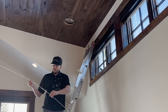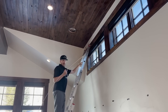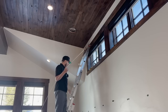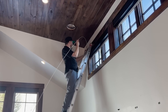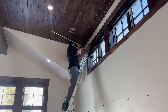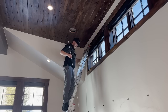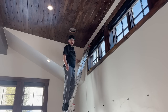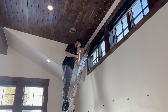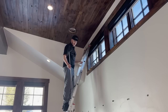These are called fish rods — they're flexible yet stiff enough to run wire through the wall pretty easily. I'm going to check what kind of framing we have in this wall because a lot of the time there's a fire break, which means you need to cut more holes. We are hitting our first fire break, and it looks like it's right about here. That gives me a good reference point to check with my stud finder and then decide where to cut my hole so I can drill through that fire break.